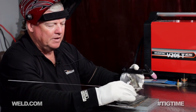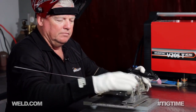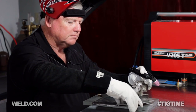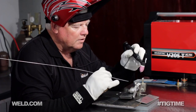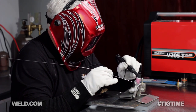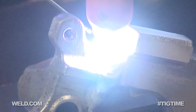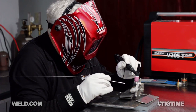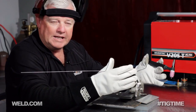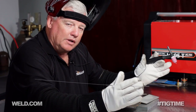Because it's a cast aluminum, you really don't know what alloy is in there, and there's actually a combination of alloys. So a lot of times I'll just use 4043 filler material. I'm going to get in position; I'm only going to do about a quarter of an inch right now. Let's go — let it cool down.